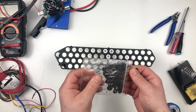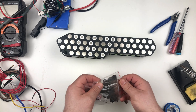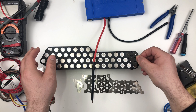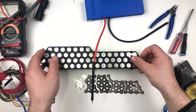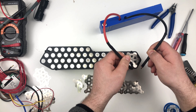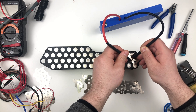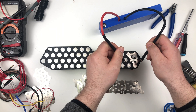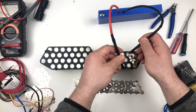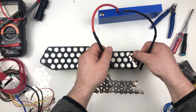I decided to use nickel plates instead of nickel strips that are made for this arrangement. You can find them for 48 volt battery arrangements as well. I will add most of the materials and tools I'm using in the description if you're interested. I will be using the spot welder I reviewed in my previous video. Using nickel plates makes the task much easier and less messy — I would suggest going for it, as the difference between this and nickel strips is just a few bucks.